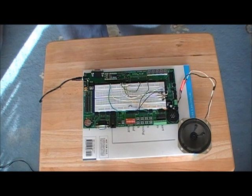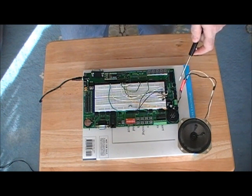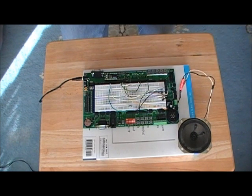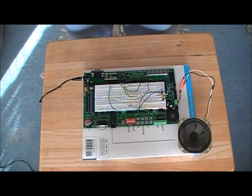This is done on the professional development board made by Parallax. Here is the Basic Stamp 2 microcontroller. We are going to use these 2 pots for tempo and frequency of the notes. This is the audio amp volume and we have a normally open push button that is going to be used for record. The only components external to this board are these 2 capacitors — both 0.1 microfarad capacitors — used with the 2 pots separately. They use the RC time instruction in the program to get an analog read from the position of the pot, scaled with equations into tempo and frequency separately.